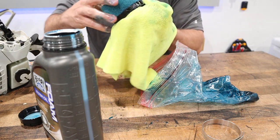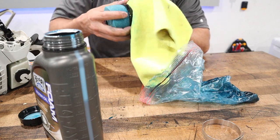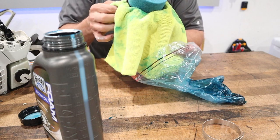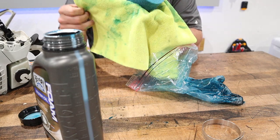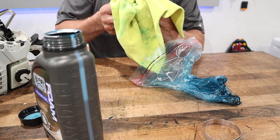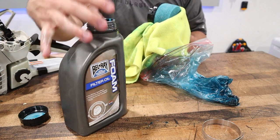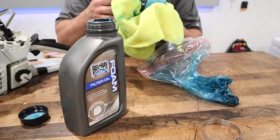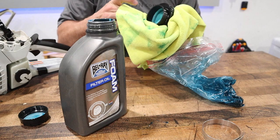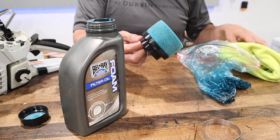I'm going to wipe my hands off and wipe this plastic off. If you reuse an old bag, the oil gets really, really sticky — it's not a game changer, not that big of a deal. It just makes it a little bit harder to apply when it's really sticky. Coming right out of the bottle it's pretty runny, so it makes it easier. But I just choose to not waste the oil and I like to reuse the bag, so I put up with the stickiness. Let's go ahead and clean it the rest of the way off — now I have a nice oiled filter that's going back on the chainsaw.